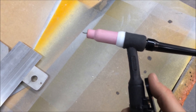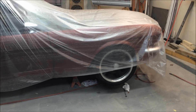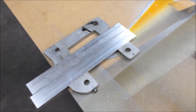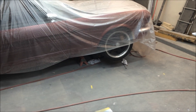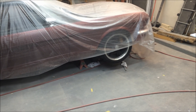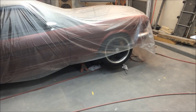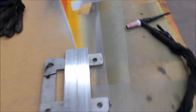I'm using the thumb control right now because when I get under the car to weld the oil pan, I won't be able to use the foot pedal. So I'm practicing with a static setting on the welder — there's no variability with the thumb control. On the car, I'm just going to do one-inch or so stitches so we don't superheat the oil pan and melt the gasket.